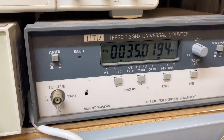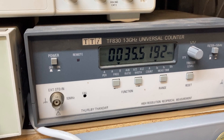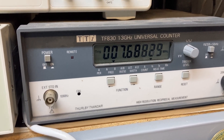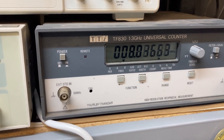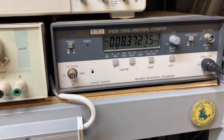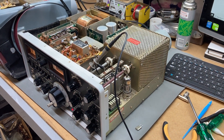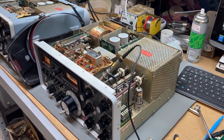10D should be 35.52 — clicking across there — 35.519.2. Then WWV: that's moving around as well. And lastly, 160, and that's all over the place as well. So that's what I'm getting, and next I'm looking at the trimmer deck on the underside of this radio to see if those capacitors can be tweaked and repaired.